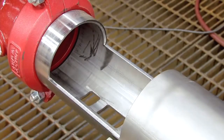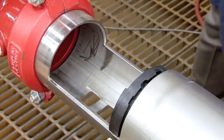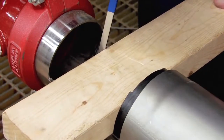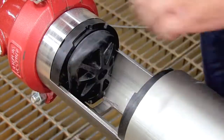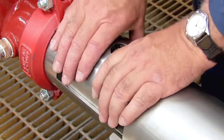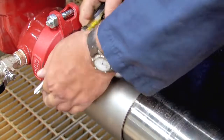When rebuilding the assembly, the number 2 check should be replaced first, followed by the number 1. If either check cannot be reinstalled by hand, place a small piece of 2x4 against the check body and gently apply pressure to slide it into place. Thorough lubrication of the O-rings with an FDA approved lubricant will help during reinstallation. With the checks replaced, reinstall the stainless steel retainer plate and slowly close the cover sleeve, once again using a number 3 Phillips head screwdriver as a handle.